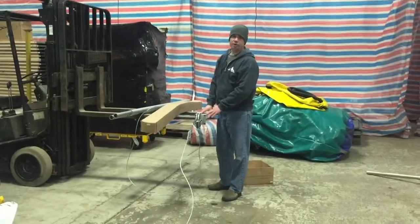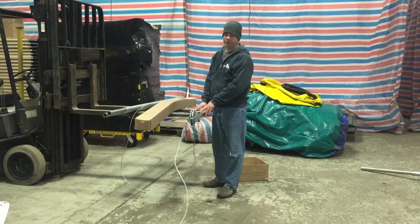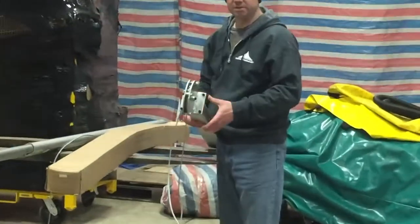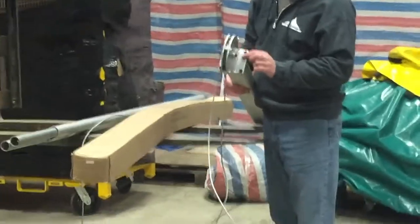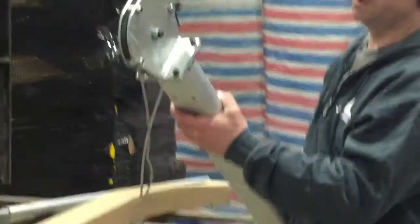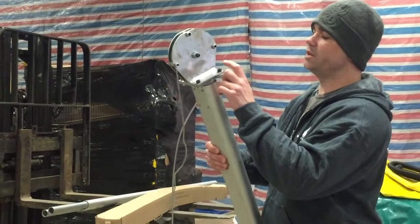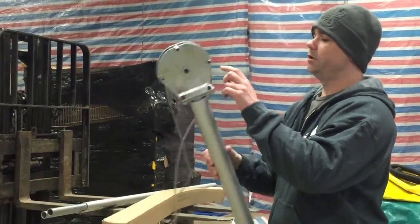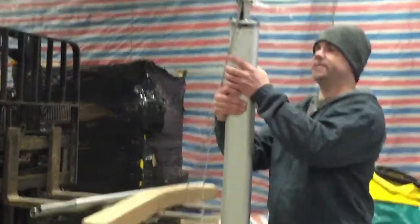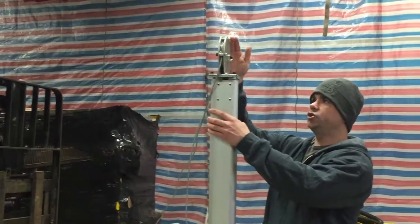One of the first things you're going to want to do when you do your frame tent jack assembly is mount the top of the winch. So here you can see is the top assembly, which we showed you comes in the box. You're going to mount it right to the top. As you can see, it will sit right on the plate and can be affixed with these 1, 2, 3, 4 bolts and nuts.